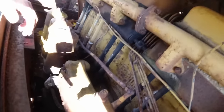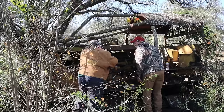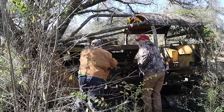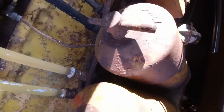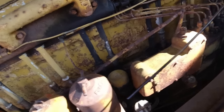See, how old your engine goes is you turn your diesel motor over, like you were saying, to get your oil pumped up. And because you have to watch your gauge, even with a pony motor. And when your fuel pressure and the oil pressure gets built up, that's when you kick it in and get that compression on your motor. Right. It's got plenty of oil in it.